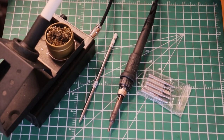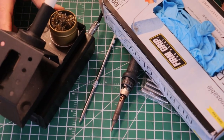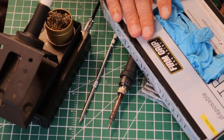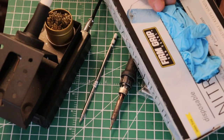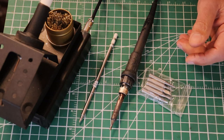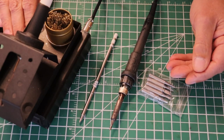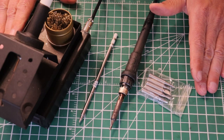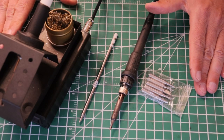Right now we're really talking about safety. When you're done soldering, even if you're just taking a short coffee break, you should wash your hands to get rid of any residue. You could wear nitrile gloves - that's a possibility. If I had young children in the house or a baby, I probably would glove up. If it's just you or you and your partner, just head over to the kitchen sink, put a little bit of dish soap on your hands, and give them a good scrub. The other thing you've got to watch out for is ventilation - it's absolutely critical that you work near a window and open it at least partially, even in the winter, so you have good fresh air.